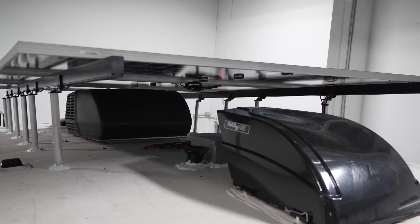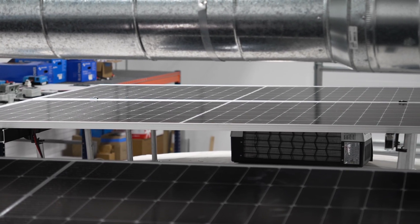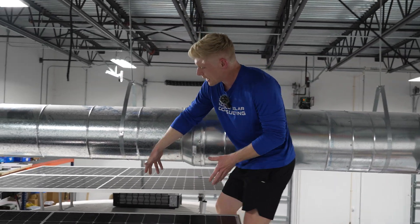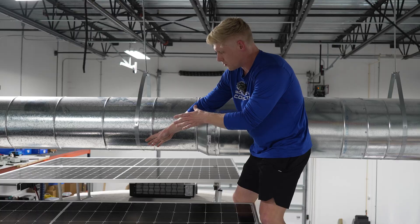This customer really wanted to max out what they could do with solar, so I told them the best way to do that is if we clear cover over top of the air conditioners with bifacial solar panels and elevated the solar panels. We've got our rail system holding them in place and we've still got a nice walkway — we didn't want to take away their roof's accessibility. They can still crawl and walk really all the way to the front of the roof. They have a big access point here in the middle to get into their Max Air fan if they need to.